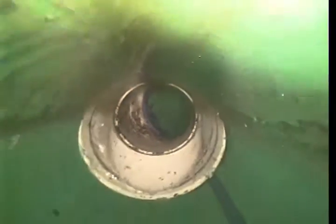Going through an aspect change and the top of the pipe is now — here we go. Here's where we transition from clay tile pipe into green PVC. This is right at about 98 feet from the clean-out I'm working out of. You can see the primer and the joint and how it was laid. Continue to pull back. PVC is much more preferable than any other pipe that we see. Going through a bend here. Joint looks real nice. Going through another — joints look nice.